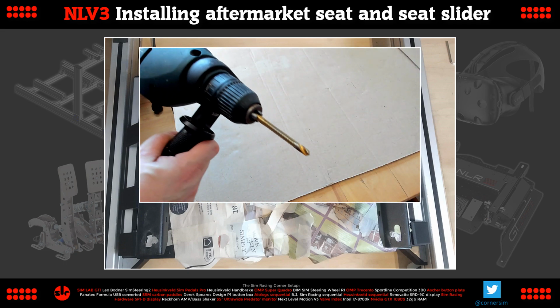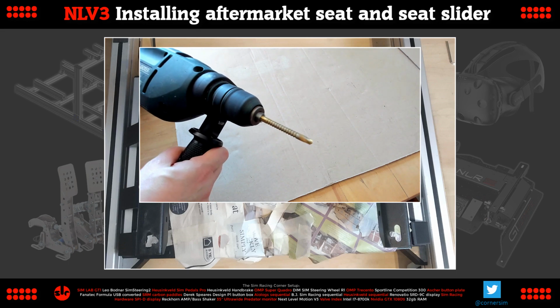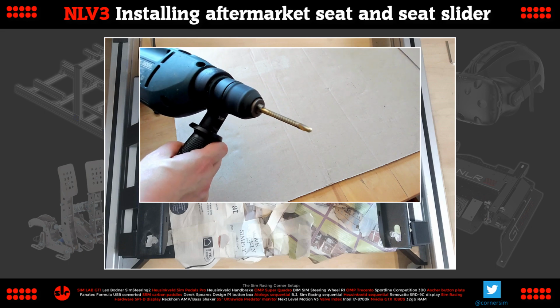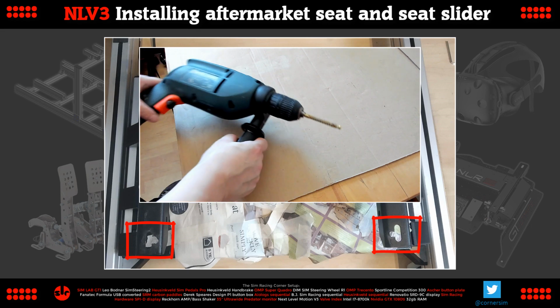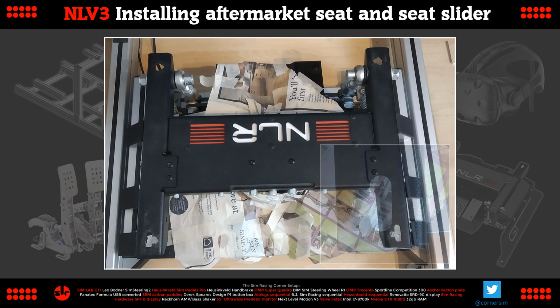My first attempt was using this special drill bit designed for cutting sideways. You draw the drill back and forth and it will eat away at the metal. I used this tool to cut the lower holes, but I wasn't happy with the job. It was a bit scrappy and not as accurate as I would have liked, as you are fighting the pull of the drill rotation during the operation, and it wasn't even that quick. So I would not recommend this tool for this particular job.